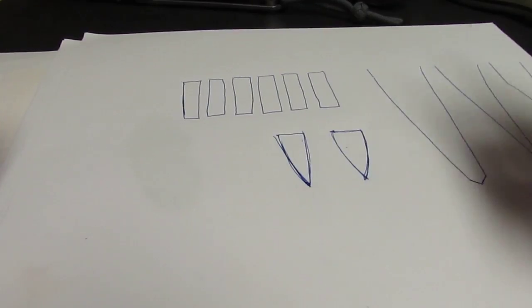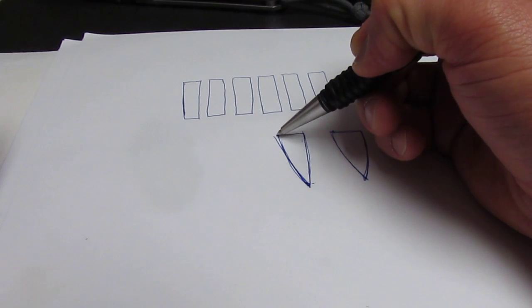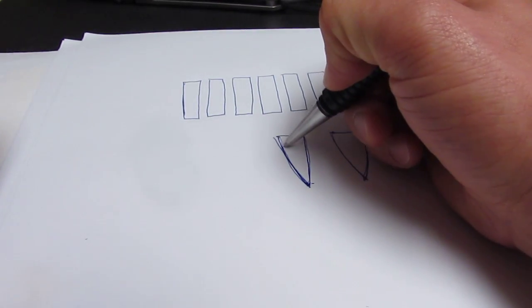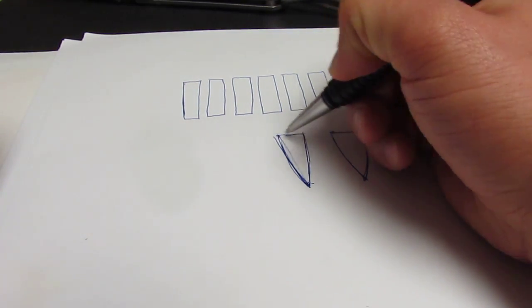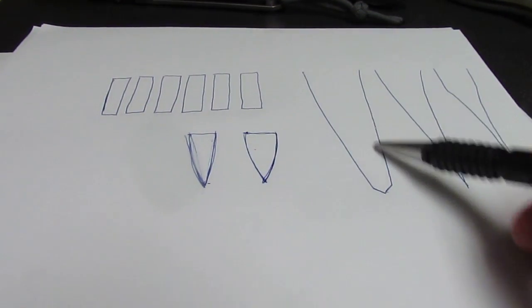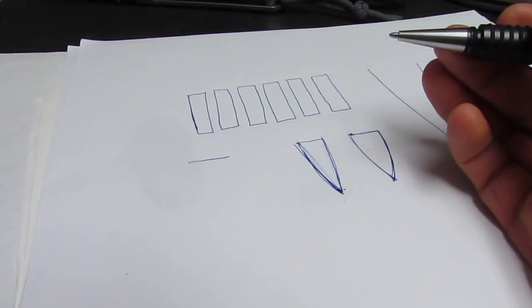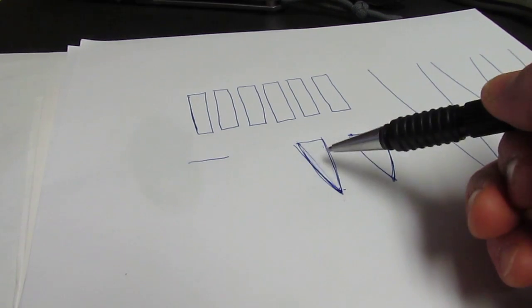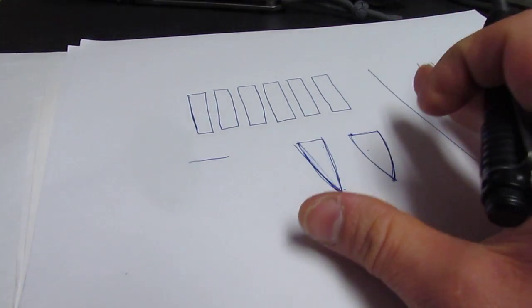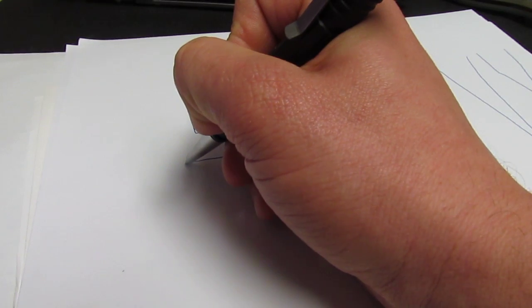Well, my whole point is, once you convex that to the same angle and you knock down all the shoulders, at that point you could still even go leaner if you want to and do a zero flat grind. So a zero convex grind is not fair to compare up against something like this, right? And that's pretty much a Scandi grind, where it goes down to zero, and there's no argument. Around the world, Scandi grind has proven itself. There's no argument there. That doesn't mean that convex doesn't work. I'm just saying there's no argument that Scandi grind works. It works.